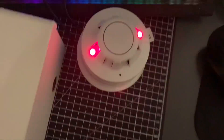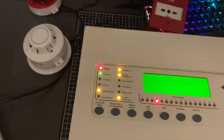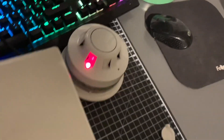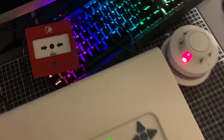I do have quite a few more addressable devices to add, like a heat detector, an XP95 detector, and optical ones as well. I'm just going to leave that alarm because I don't want it to re-trigger, as the base sounder is much louder than the beacon base.